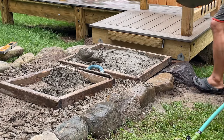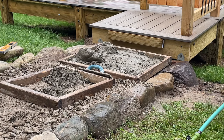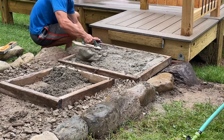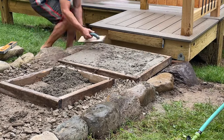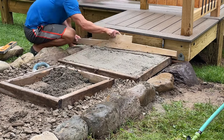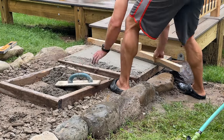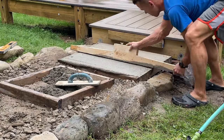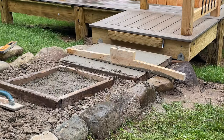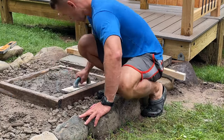Finally, time for cement. These forms I had laying around — I actually use them whenever I have a cement truck and I take the leftover cement to make little stepping stones. For these, I mixed up QuickCrete in a wheelbarrow using the 80-pound bags. I believe the bigger form took about two and a half bags of QuickCrete. The QuickCrete itself doesn't have the exposed aggregate — it doesn't have the pebbles — so you have to add them in afterwards. If you do order a cement truck for exposed aggregate, it'll actually come with the pebbles in it. You have to specify to the dispatcher that you're doing exposed aggregate and they'll put it in there for you.